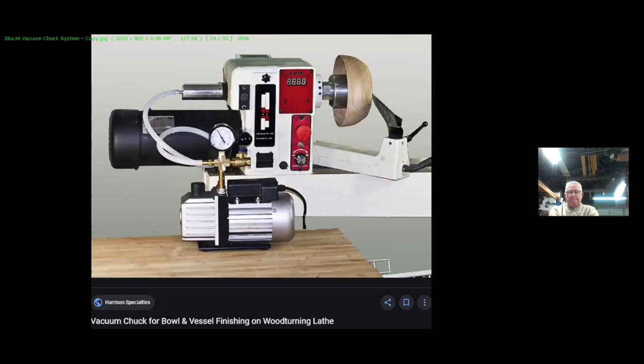I was thinking in terms of the volume inside the vacuum chamber. It would change. No, it doesn't. It's irrelevant. The area is the only thing that matters. The area of the air. In other words, I wish I could draw you a picture, but there's only 4 inches of this bowl that's exposed to the air that doesn't have air on the other side of it pushing the other way. When you evacuate this bowl, there's a low pressure in a circle that's 4 inches in diameter. So the air is pushing on it, but all it can push on is 4 inches of diameter.